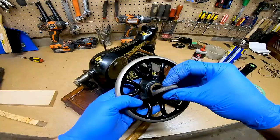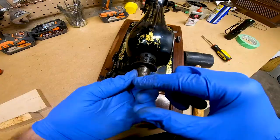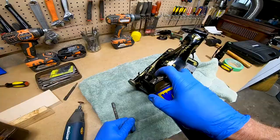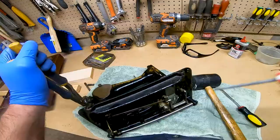The first challenging part is removing the bushing that's attached to the shaft at the outside of the machine. I found the best way to do this is to grind down the pin with a rotary tool, add some lubricant, and knock the pin out with a punch. For the record, I don't actually know if it's called a bushing — in fact, I don't know what any of these parts are called, so I'll just make up names along the way.